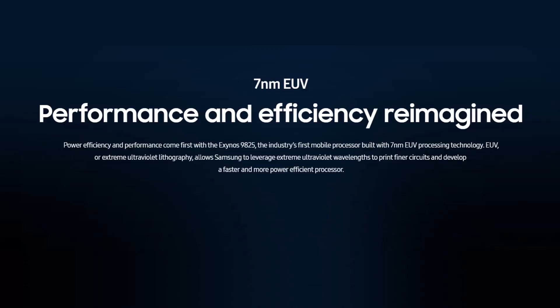Every processor when it's built has to go through a fabrication process where the circuitry is transferred onto the silicon, and that's done at the nanometer level — really, really small. The way they do that is using etching and by using light waves. In this particular case, Samsung have developed a new process using extreme ultraviolet light. So the 9820 found in the S10 was built using an eight nanometer process, and the 9825 is built using a seven nanometer process — a different process — now using this new EUV process that Samsung have developed.